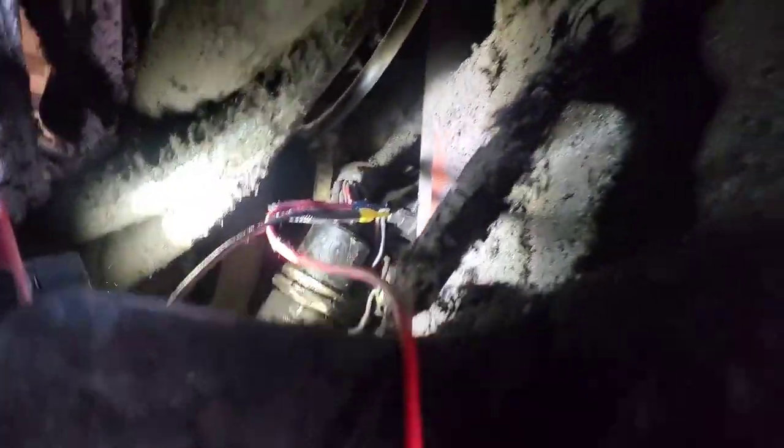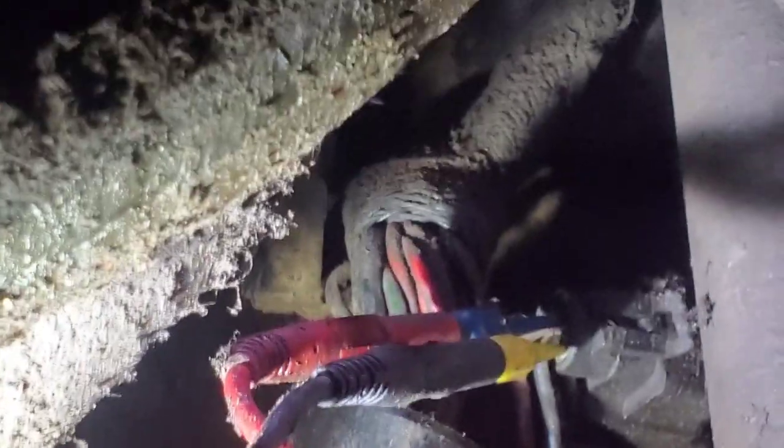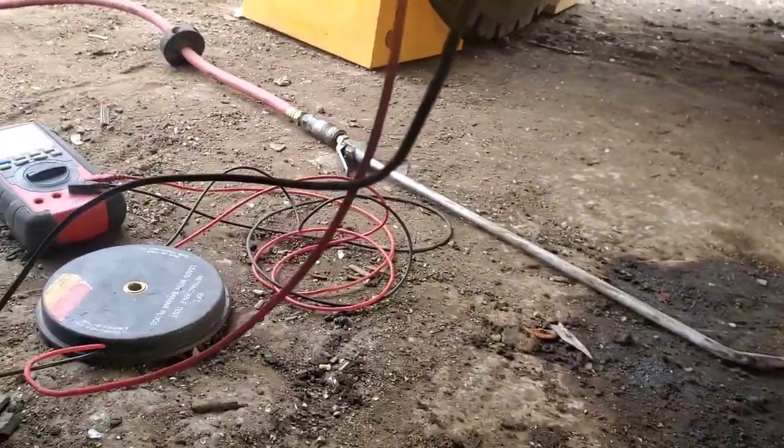About 15 minutes later I found out that I could sit on the front side and look back — still not easy, but I am probed into my number one clutch pack solenoid. You can see there's the other one there, and that one should be number one. I think I've got a solid connection. I also wanted to get my leads poked up top — I've got 15 feet on these, hopefully enough to get all the way up and around.